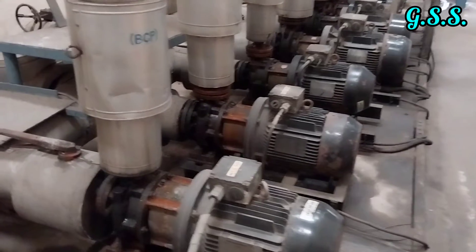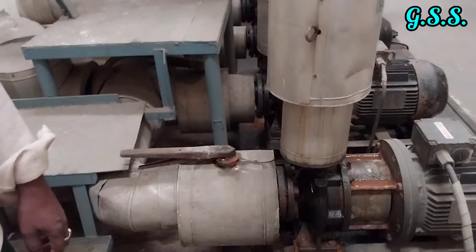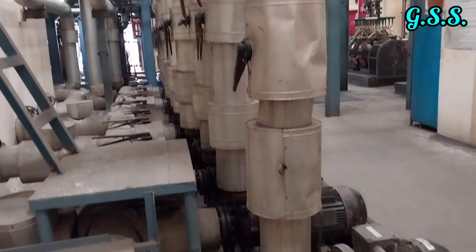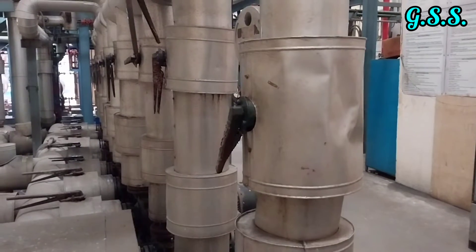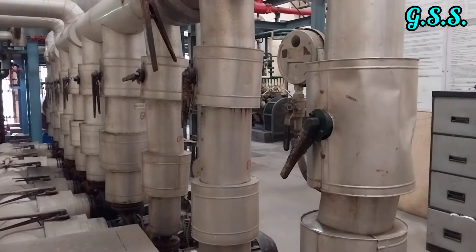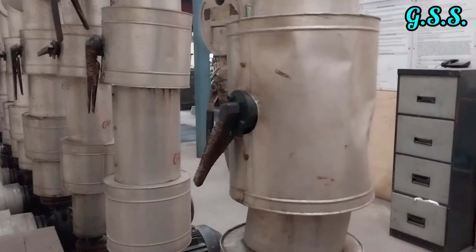These are a series of chilled water pumps for pumping chilled water at about 5 to 8 degrees Celsius. Chilled water lines are insulated using nitrile rubber sheet and aluminium cladding. Now let us see how simply these types of chilled water lines are insulated.